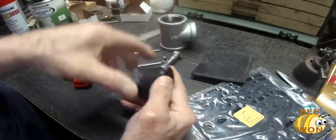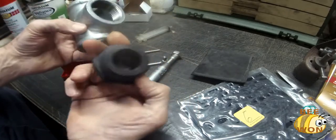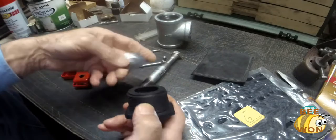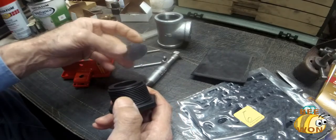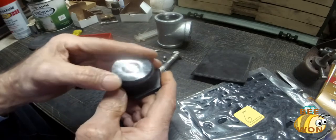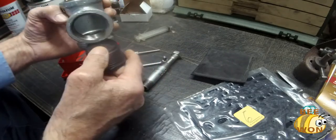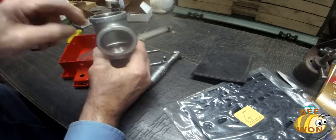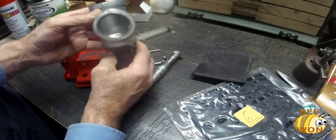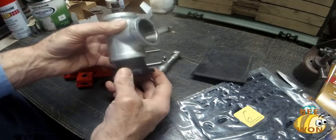This nipple — I got a plastic plug, an inch-and-a-quarter plug — it's going to go up here where I'll be able to drain my media. But it's got a hollow wall in it and I don't want a lot of media laying down in there. So I've got a plastic coffee can lid, I cut it out, and I'm going to probably glue that on there. By the time it goes up in there, it's going to make the vacuum effect better. When most of that bottom area is filled up, it's not a cavity — it's more filled in.